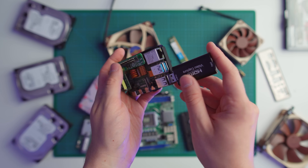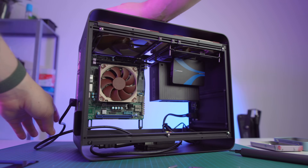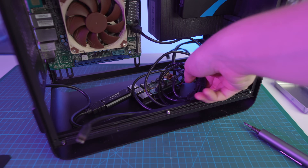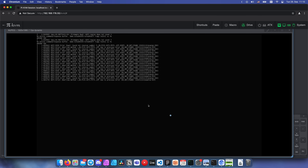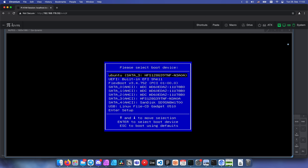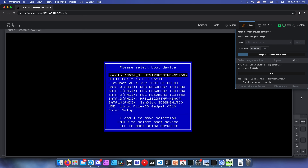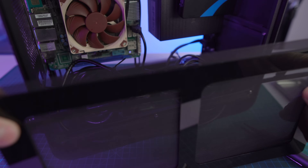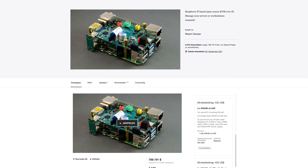So instead I used this: a Raspberry Pi with a USB Type-C splitter and an HDMI capture card running PiKVM. The capture card connects to the HDMI port on the board and the USB Type-C splitter connects to a USB port on the server. PiKVM gives you a nice web interface where you can see the display output, use the keyboard, upload ISOs, and boot from them — since the Raspberry Pi can pretend to be a mass storage device. It can add remote management to any motherboard and is very cheap compared to a server motherboard with built-in IPMI. There's also a Kickstarter for a PiKVM HAT, which is an all-in-one solution without needing the separate splitter or capture card, so check that out.